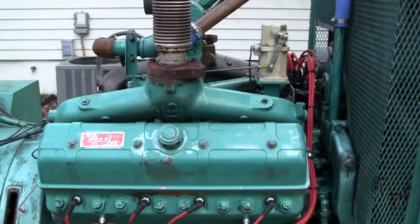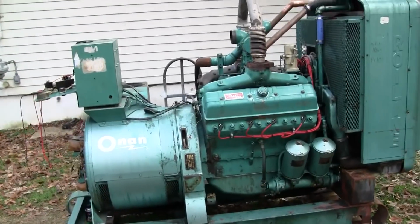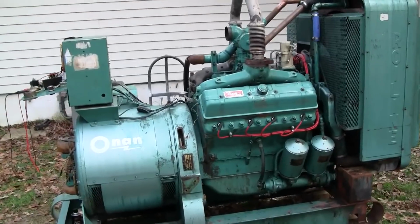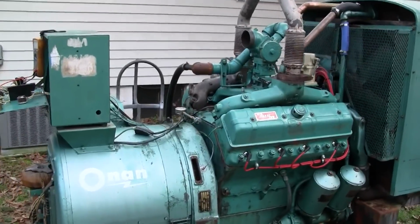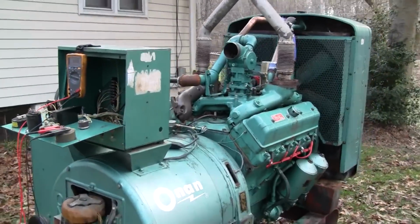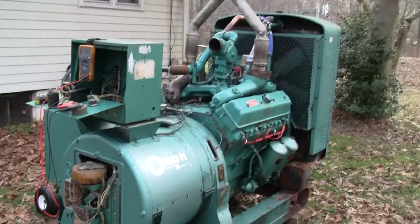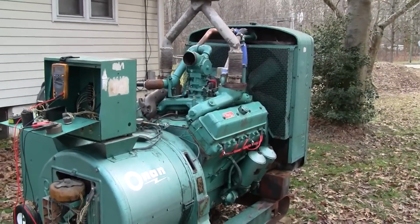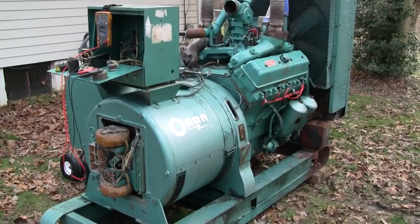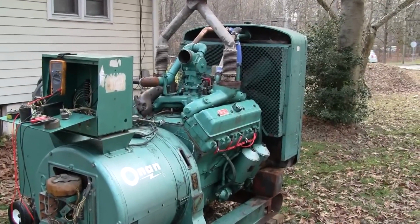Alright, well, that's about the end of this video. So, we did get a successful governor installation. However, we cannot test it fully here with my meager fuel supply. So the next step with this thing is to put the air filter back on, put all the covers back on, and haul it into the shop at work where we got the big 2-inch gas feed for it, and hook it up to a load bank and see what it can really do.